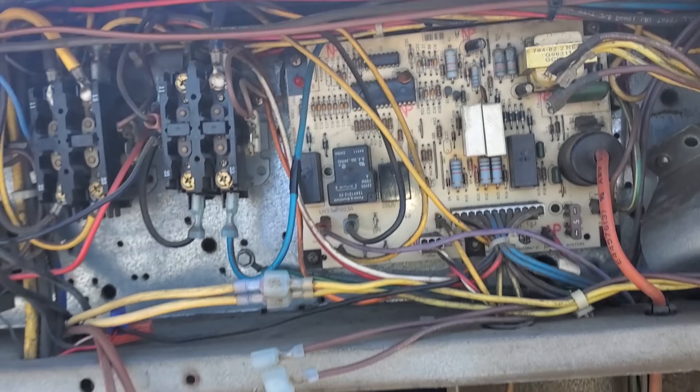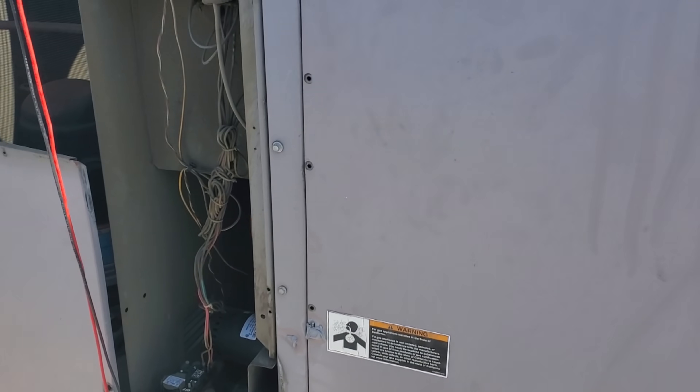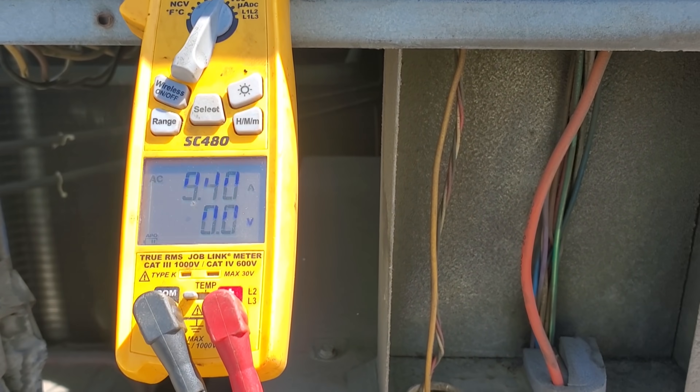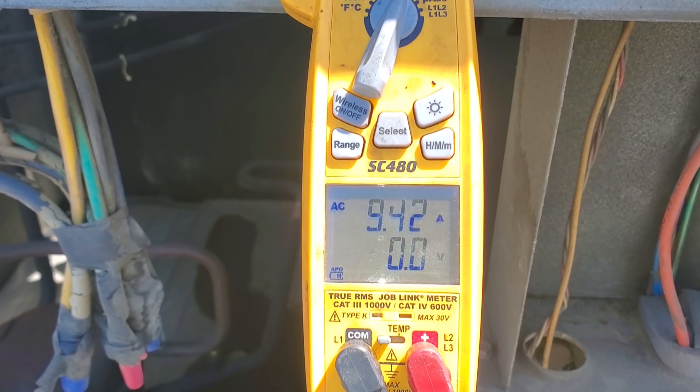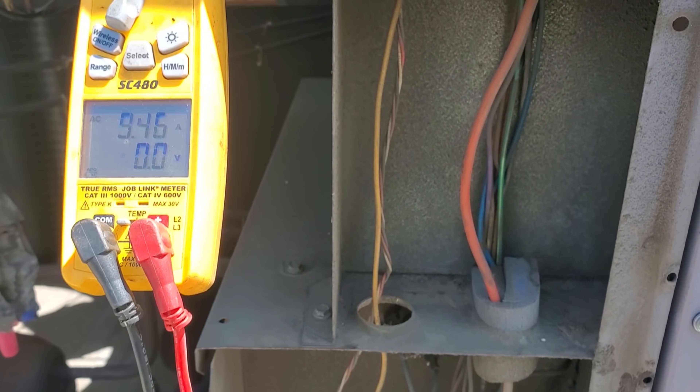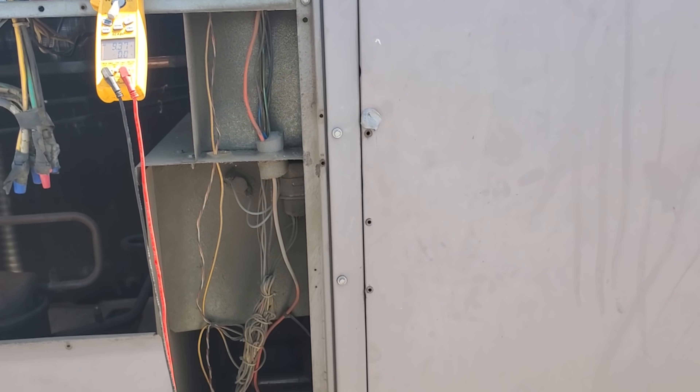It's not really part of my quote. We'll test them. I got the blower running and it's running in the right direction, I confirmed that. But here's the problem — we're over amping. We're allowed to run 7.5 amps. I matched that pulley exactly to what the other one was. So why are we over amping? We've got three phase power. I did test that.